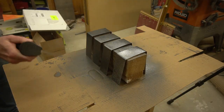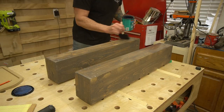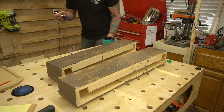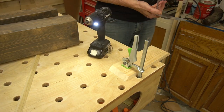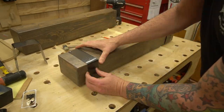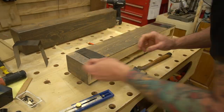With the aluminum now prepped for paint, I used Rust-Oleum hammered paint on the straps. To seal and protect the shelves, I chose polycrylic in a matte finish and applied a couple of coats with a light sanding in between. With the shelves sealed, it's time to install the straps — but first we need to drill a couple holes in them. While at the hardware store, I came across really cool nails that look like they were forged by a blacksmith — they're actually just carpet nails, and they fit the piece perfectly. Now let's take a cinematic look at the completed project mounted up on the wall.